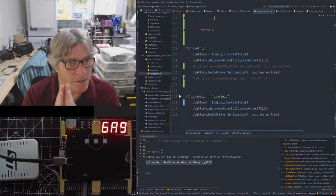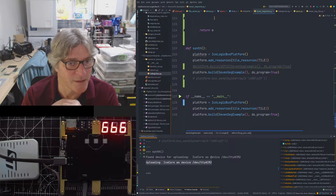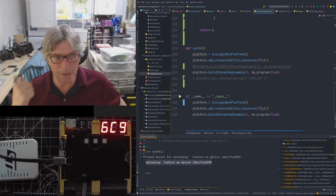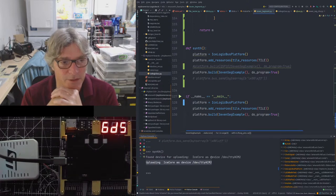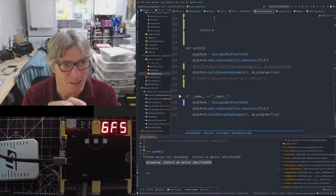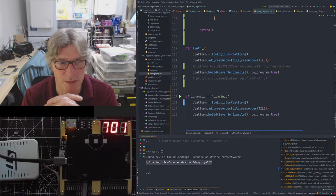So yeah, why was I talking about that? Oh yes, because Laurie asked me if I'd managed to fix that, because I was saying I was going to have to transplant a new STM32 on there, on that one. But I don't know if it's going to be recoverable, because there is some pad damage. And the trouble is, when you get a bit of pad damage on a TQFP, chances are that the reflow is not going to go well when you put the new chip on there.